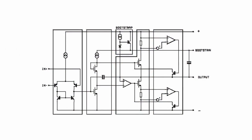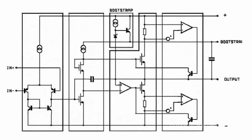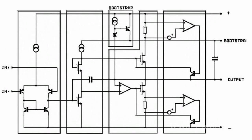The chip belongs to class AB amplifiers. Its main feature is field-effect transistors employed in preliminary and output amplification stages. The assembly has an internal short-circuit protection and overheating protection. It also supports the signal attenuation function and standby mode if there is no signal at the chip input.